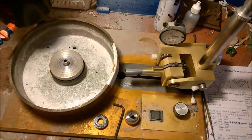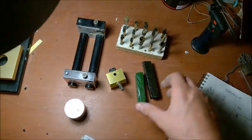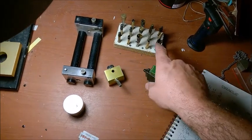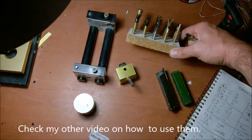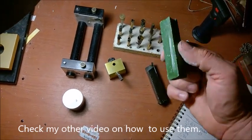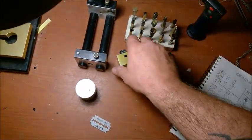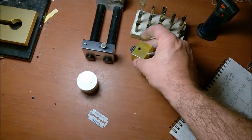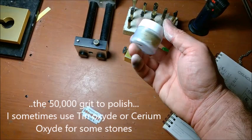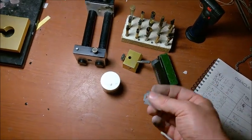Let's pass to the tools that you really need. Other tools you really need are a gas torch, just to heat up the cutting wax — this holds the stones. These are the dops, which are supplied with the machines. Whatever machine you buy, you're going to have these dops in different shapes and different sizes. You're going to melt the wax with these to set the stones into the dops, to dop the stones. Of course, a transferring block — which also comes with the machine — with a 45-degree extension to cut the tables, and diamond powder. You also get some of these, which are very useful to clear up the wax from the stones.